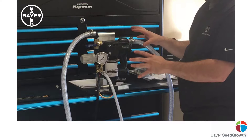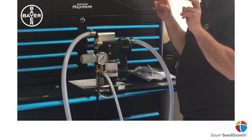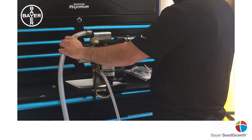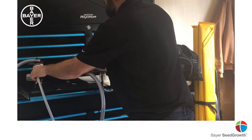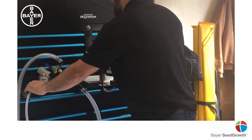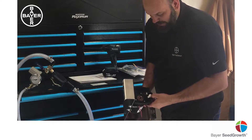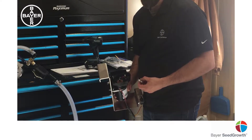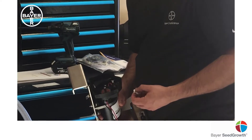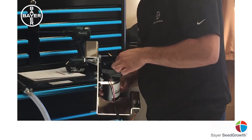I've left all of the fittings on — if you have them off already it's a little easier, but I wanted to show you how to do it without making too much of a mess in the field. This top just gently lifts off. Now in here there's a spring and this little white thing — this can all come out. My advice is don't touch it at all. Be cautious. If you're doing this in the field, don't drop or lose this piece — without it you've lost the safety switch, the internal shutoff switch of the pump.